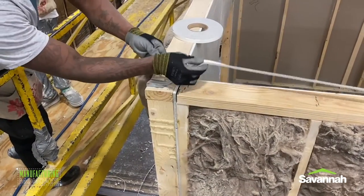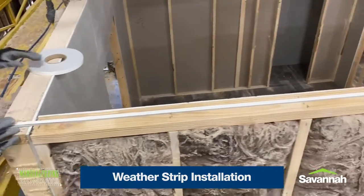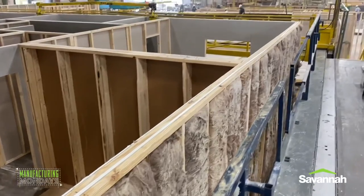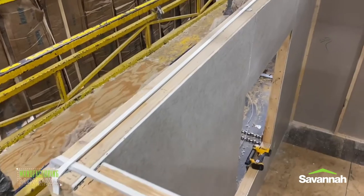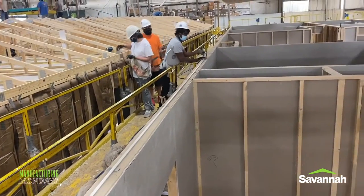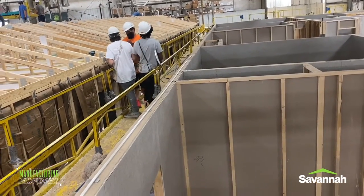In this step of the home building process, a weather strip is installed after the wall has been constructed and set, and before the roof is set on top of the walls. This strip creates a seal to keep the outside elements outside and keep your inside elements inside. As you can see here, this double-sided adhesive weather strip is running along all exterior walls.